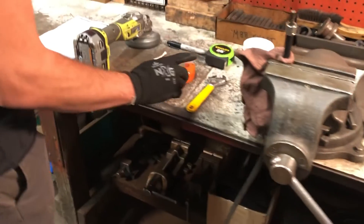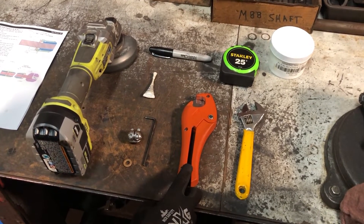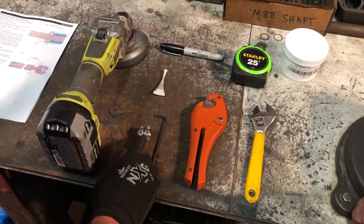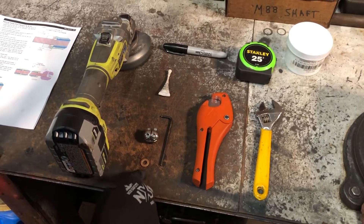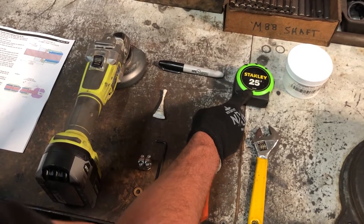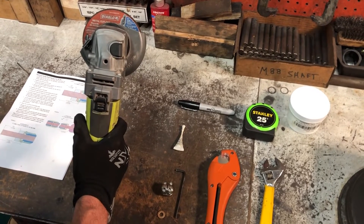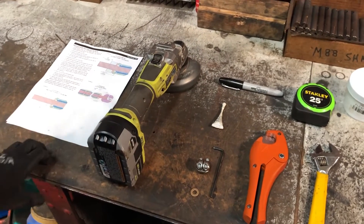The tools you're going to need for this repair are an open-ended wrench, a tubing cutter or utility knife — in this case the General Super Slice — a 9/64 Allen key which is supplied with your flexi-rooter, a flexi-rooter shaft coupler for the cutter end, the bronze thrust washer, the Loctite supplied with flexi-rooter, a tape measure to mark where you need to make your cut, a Sharpie or other marking tool to mark your shaft, and most critically a cutting tool with an abrasive cutoff wheel — in this case a battery-powered angle grinder. It's also a good idea to have your flexi-rooter instructions handy.